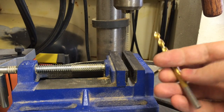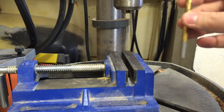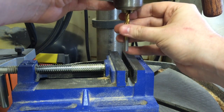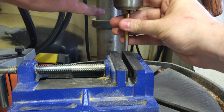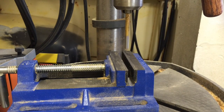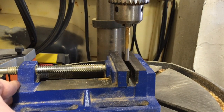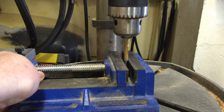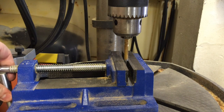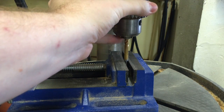We need to get our bit aligned with our vise, but remember we're going to be flipping this upside down. The way to get this perfectly aligned is to chuck our bit upside down in the drill press and just barely tighten it — just enough to hold it in place. Give it a quick turn to make sure it's good and not going to go anywhere. Then drop it carefully down into your vise. Move the stationary side of the vise — in this case, the right side — over so it just barely kisses the bit, then tighten up the other side and get it nice and snug. Tighter is better than looser.